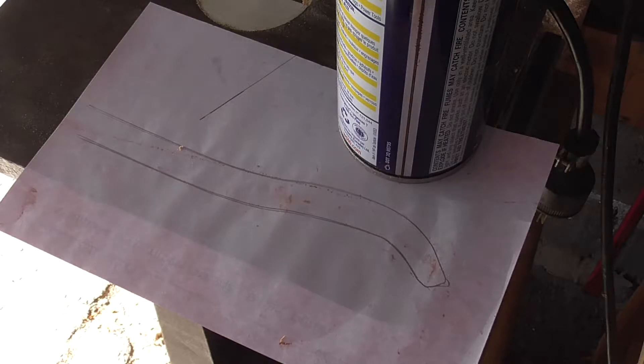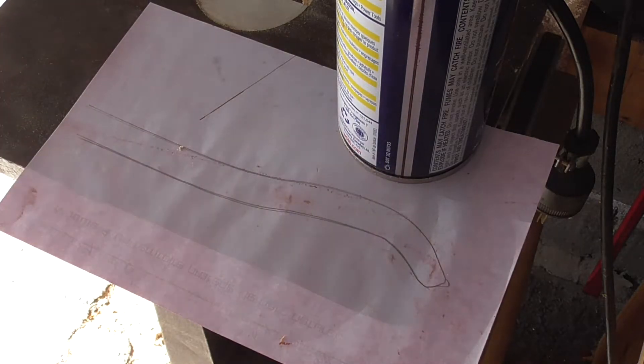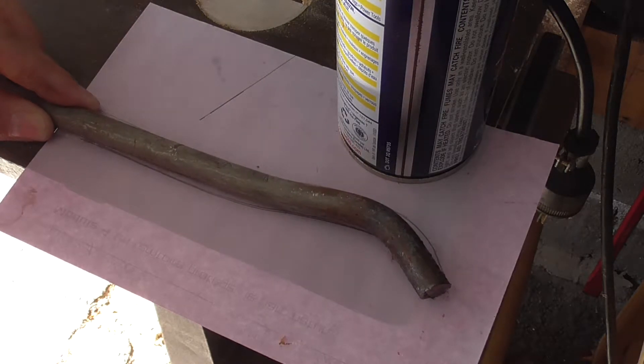About the cutter, I will use half of an inch mild steel rod, and I have to bend it in the shape that my Kelton Swan neck hollower has. I have a drawing to show you. This is the curve of my Kelton hollower, and the goal is to bend that rod in the same shape. I did it off camera, and this is the finished piece.